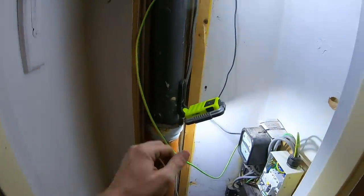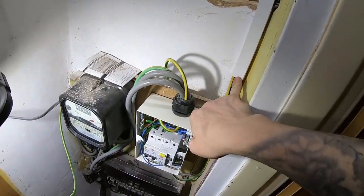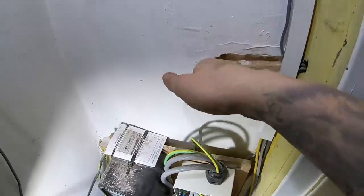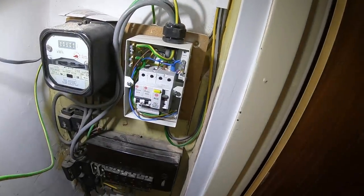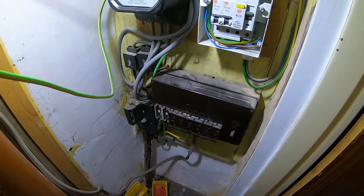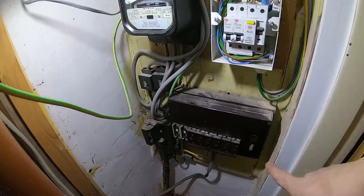Okay, first board call. We've just run all the cables through — I think a few of them have been a bit too long, never mind. Uni-light to the rescue! I'm just going to measure off this, get two lengths of trunking run down, straight to there. How many cables have I got? One, two, three, four, five, six, seven — seven circuits to run down. So I can either run two pieces of trunking or get the thicker trunking. I'll measure them out, stick them on, and feed the cables down behind. Fingers crossed they actually go down there. I'll pull this old board off — everything like that is becoming redundant, so I can literally just snip off the tails and rip the board off.